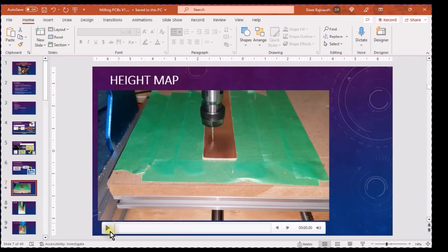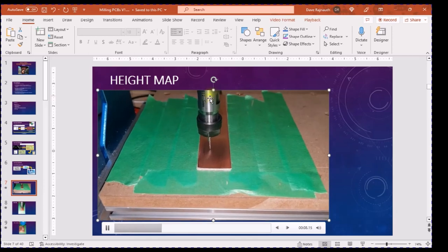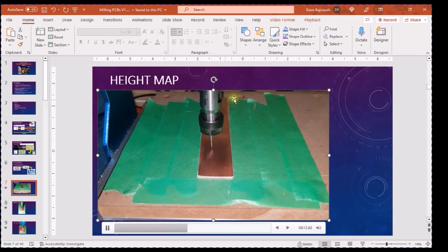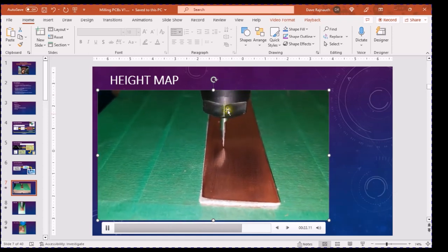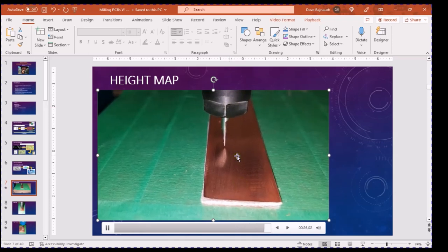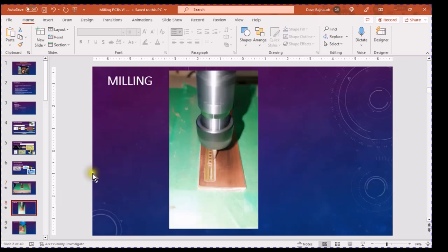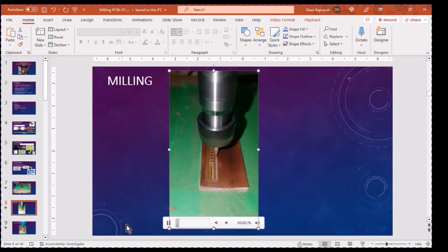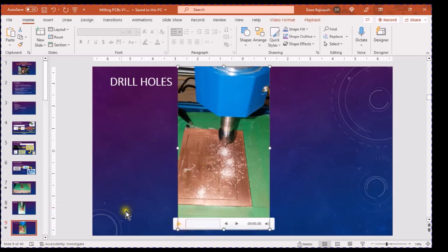Here's a little example of doing a height map. There's an alligator clip behind the bit — you have to solder a piece of copper to the board and attach an alligator clip, and attach another alligator clip to the spindle. It goes down, and once it hits the board it makes electrical connection — it knows that's the height, how far it needs to plunge down to hit the surface. Then here's a sample of it milling; you can see the little debris it leaves, which is very, very little. I'll explain the green tape in the background in a moment.